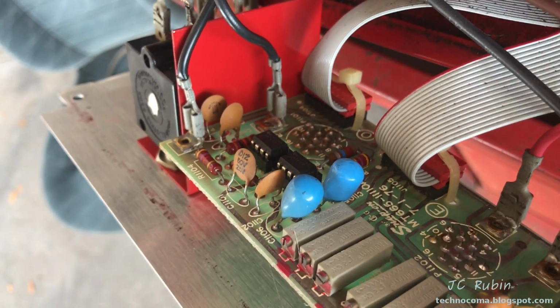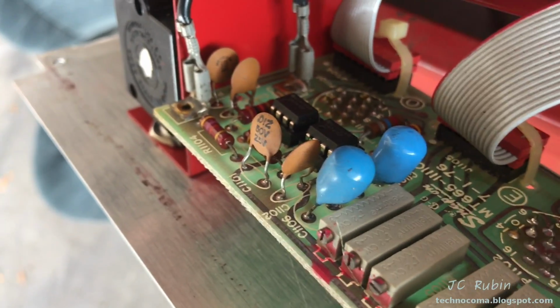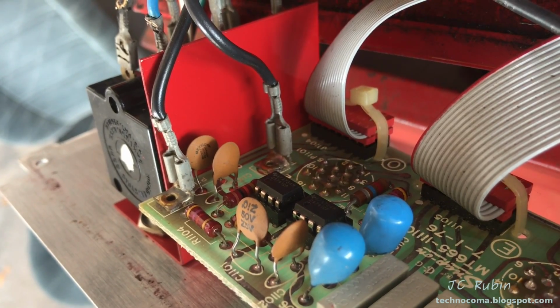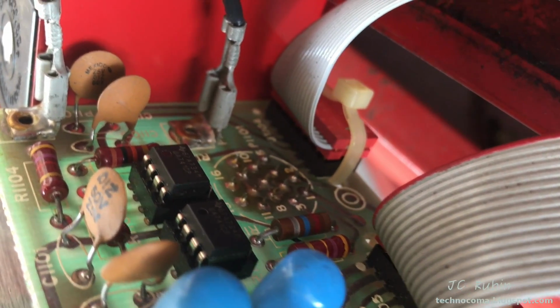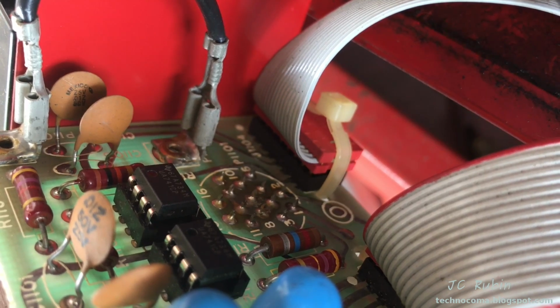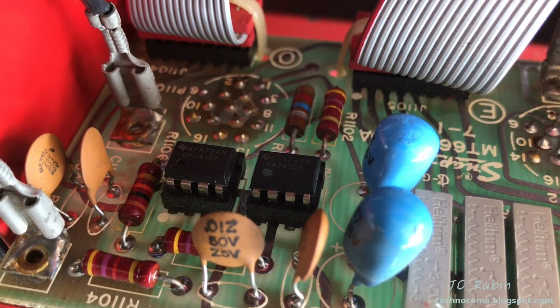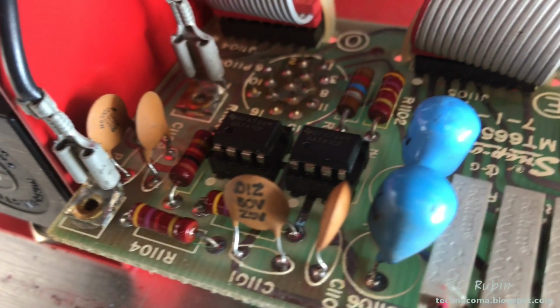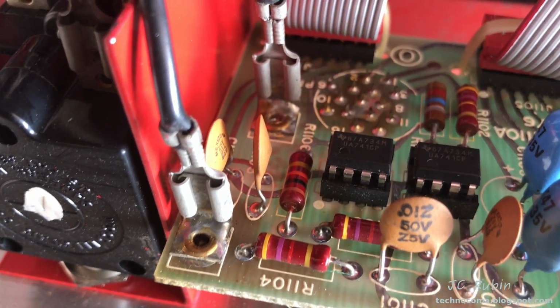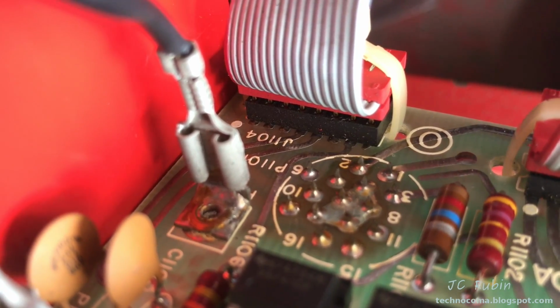Yeah, so no doubt I'm not going to be able to trace pins all the way back to these cards, because it looks like the signals immediately terminate into these amplifiers down here. Point out that while there are 3 wires, 3, 8, and 13, we come to find that on the connector 8 and 13 are common as they are soldered together. So what we're really looking at is 3 and 8. Input's going to be here, Z1101. It's going to come out pin 6 because it has to. 6 jumps to pin 2 to R1103, here to R1106. Comes off R1106 into this trace right here.